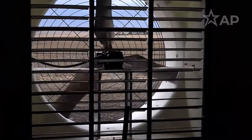The biggest thing to understand whether a fan is working correctly or not is looking at the shutters. When the fan is at full speed, the shutters should be open or fairly horizontal, to show that a lot of air is going through that shutter and fan. If the fan is not working right, you'll see that the shutter is only partially open. That's probably the biggest thing we can look at to visually see if that fan is performing well or not.